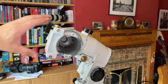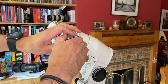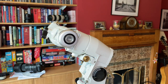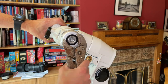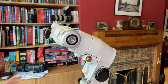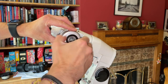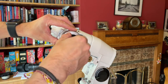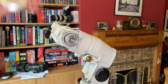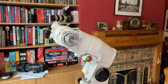What we're going to do now is a similar activity to what we've done with the right ascension. I just need to get this plastic ring off first — it was obviously a bit stiff, so I'm just using brute force through some mole grips just to loosen that. Then you've got the setting circle for that as well. Just be aware that when you're removing this, you've got the plastic ring, then you've got a nylon washer that's all greased up, then you've got the setting circle, and then another clear nylon washer behind that. Just make sure you don't lose any of those and keep them all in exactly the same order. There's some quite thick, sticky grease that's keeping that in place.